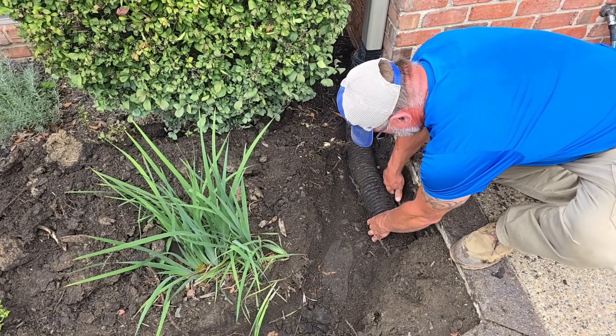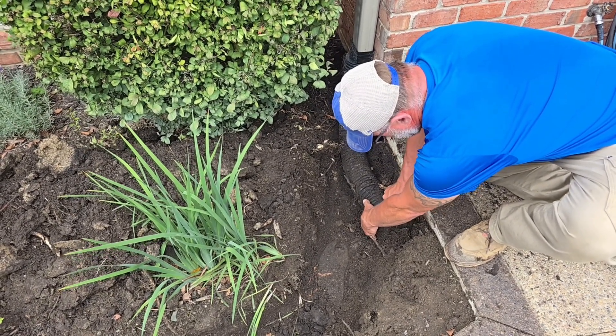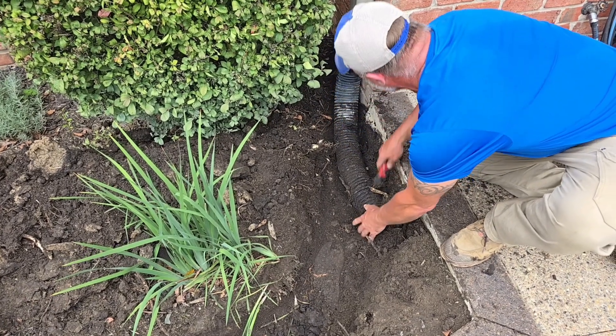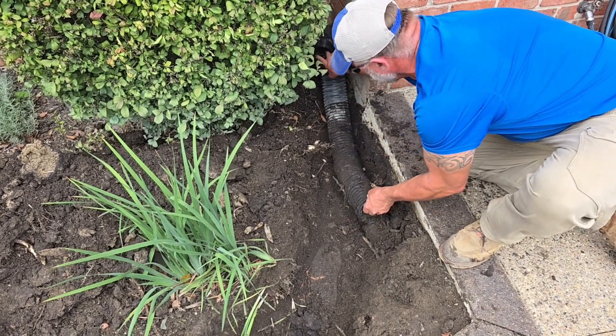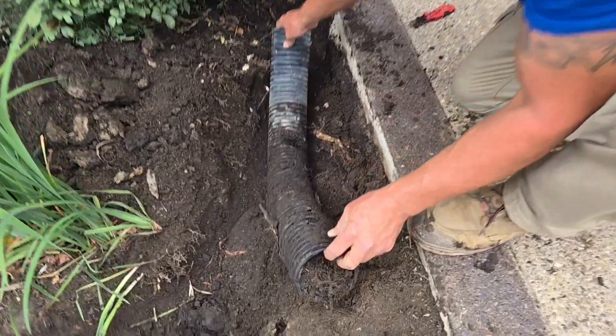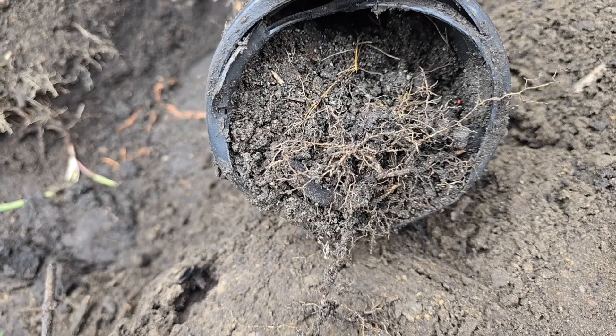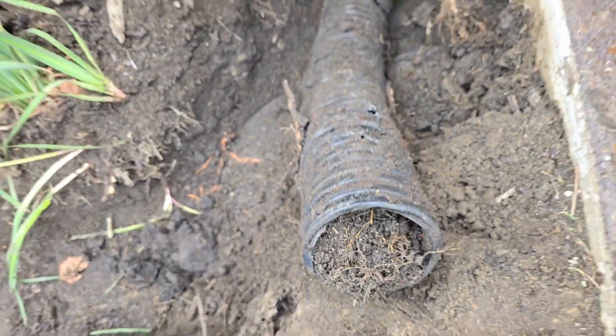You never want to use knife cut this close to the house. Because it didn't have a sock on it, that was another problem. Everybody always says, why can't you run knife cut? Well, look at that. The knife cut just filled up with dirt because there was no sock on it.